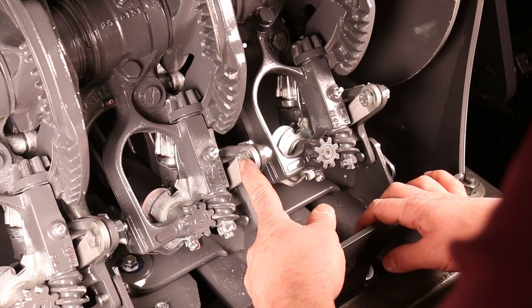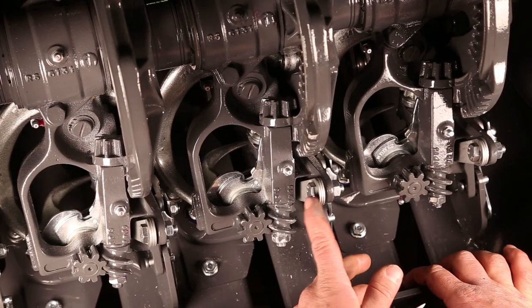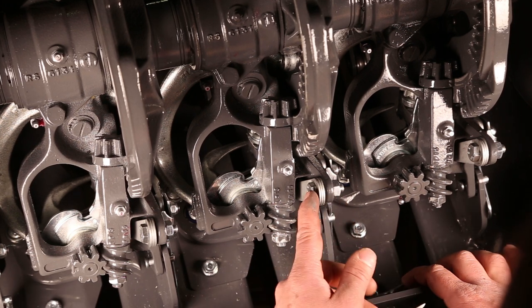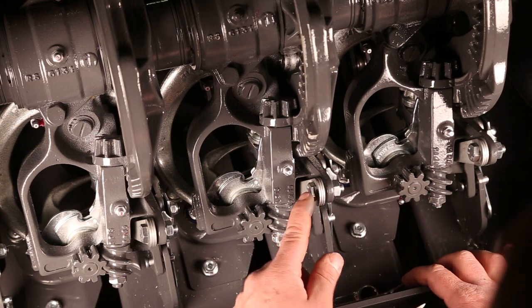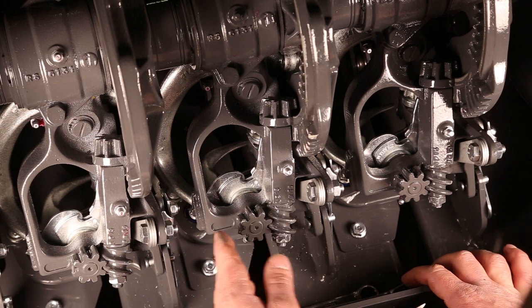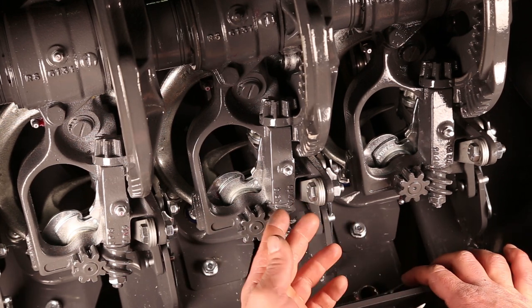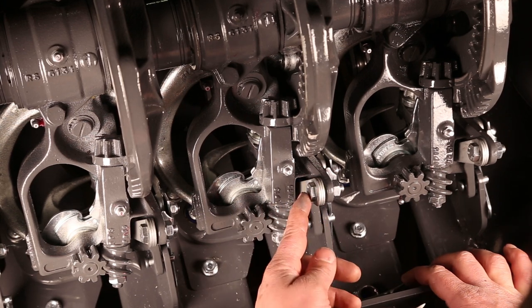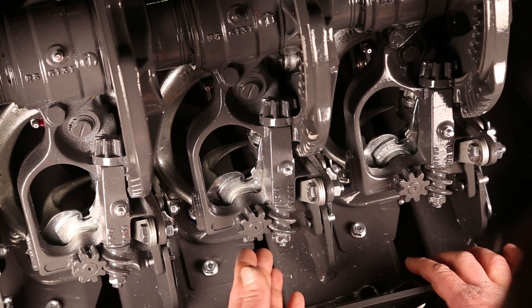When fine-tuning this adjustment: if you need to lengthen the tails, loosen the twine disc holder tension — start by loosening just one flat at a time, then judge the length of the tails and go from there. If you want to shorten the tails, tighten it up — same rule applies, one flat at a time. That's just for fine-tuning.